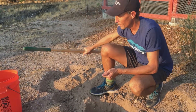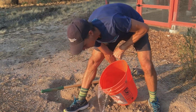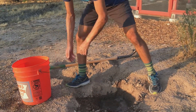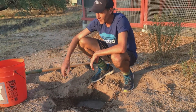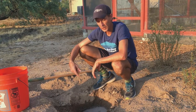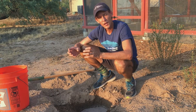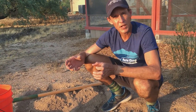After I dug my hole, I'm going to fill it for the first time with water and let that drain through, soaking into the surrounding soil. I may add a couple more buckets of water. Then I'm going to come back in about 18 hours and keep refilling — that's about how long it takes for expansive clays, if we have them, to fully expand. Once they fully expand, that's going to be our most limiting rate.